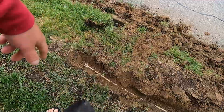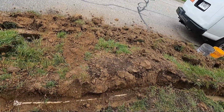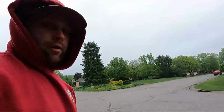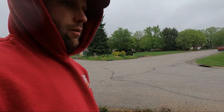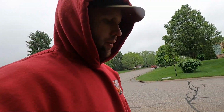I'm not sure if they 90'd out and went around it when they did the install or not, but that's a big old chunk of concrete. And we do not have 30 feet of pipe just hanging around, so I'm gonna change this out to poly. That would make this curve just nice, easy, and gentle. And it's fine, there's only gonna be 3 heads on it, so friction loss across anything to this degree is minimal. It'll be operating just fine.